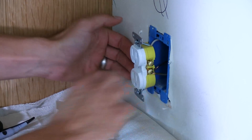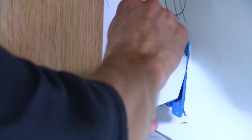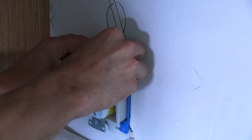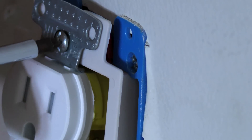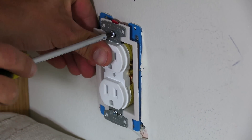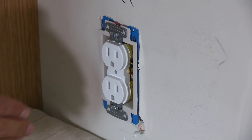I'm going to show you one more thing — this gets tile backsplash too. So I'm going to use a box extender, slip it over the top of this receptacle, and then slip these spacers. They come in strips like this; you can break them off in twos, threes, fours — whatever you need. Put it right there, slip it on my screw, and that is what's going to firmly secure my receptacle and my box extender. Get the top prepped, get the bottom prepped, and then tighten it all up at once. When your general contractors see you going through the paces and getting it just right, they go crazy — they love that stuff, they want quality, they want professionalism, and it's hard to find in the trades.